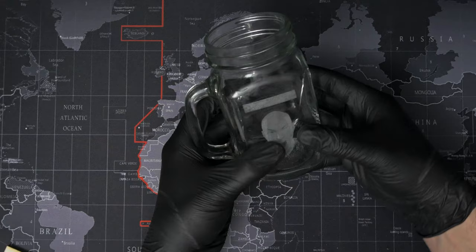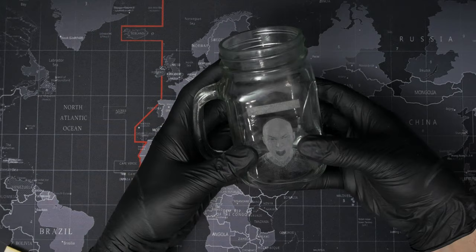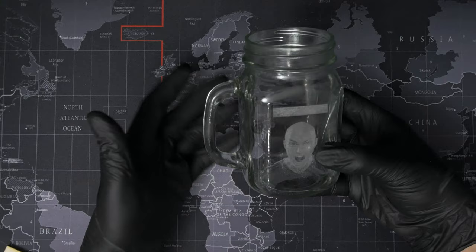Another thing I tried to engrave, which you can see here, is glass. Now, you're not supposed to normally be able to do glass on a diode laser because diode lasers around the 400-ish nanometers range are visible light, so they just pass straight through glass, and assuming it's still in focus, it'll just burn whatever's on the other side of it. So it won't technically engrave glass.